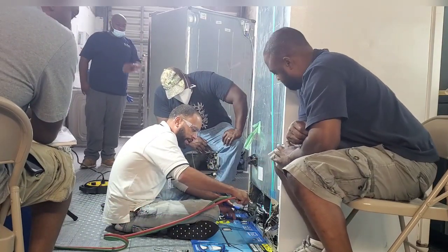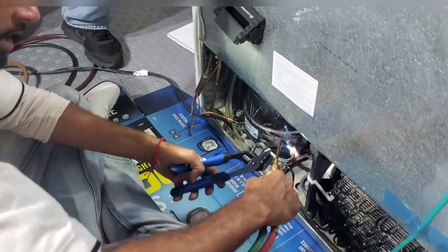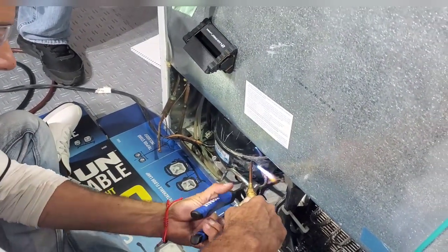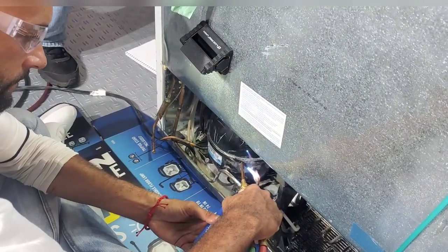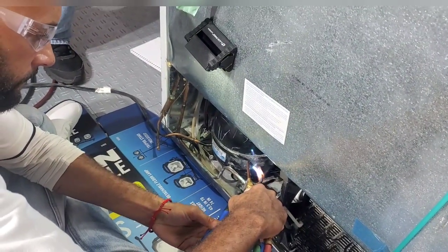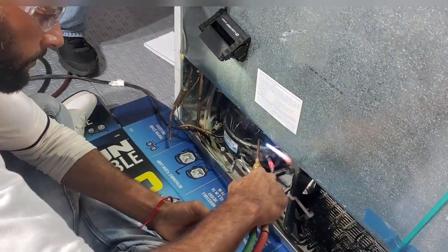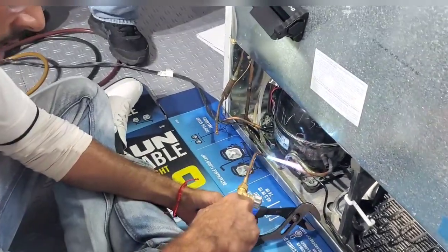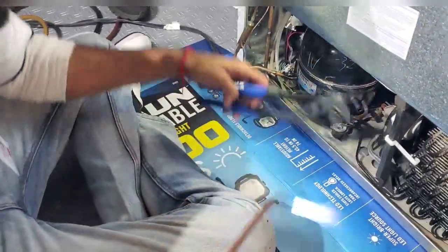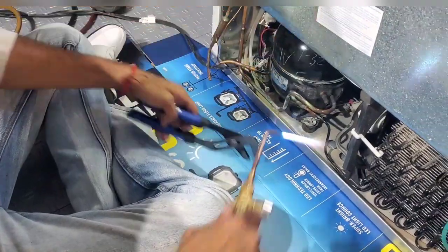What you want to do is just like a light fan motion, and you'll see that solder begin to liquefy. Watch. You want to get your — and this one, same thing. You want to hit this side, you don't want to hit this side. This is our copper tube. We want to warm up here.